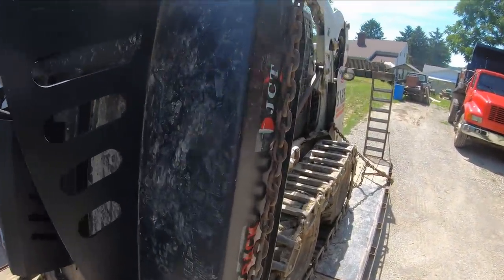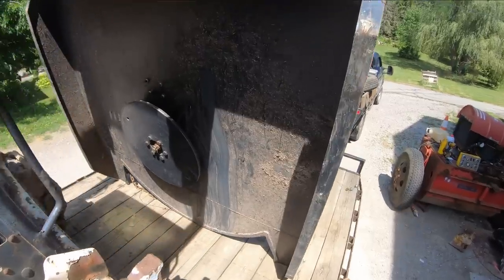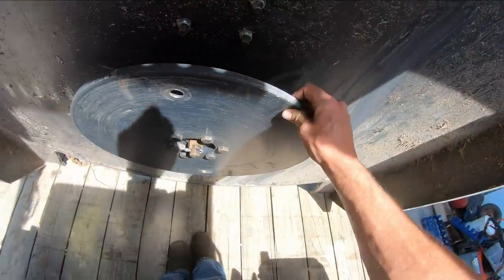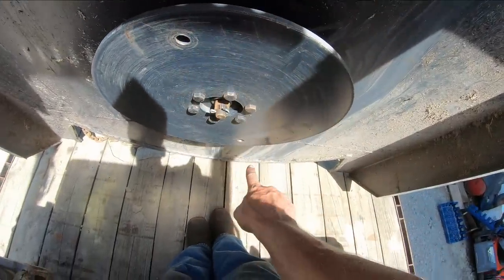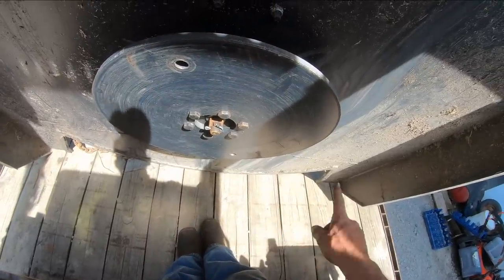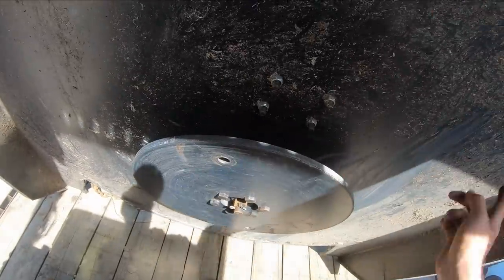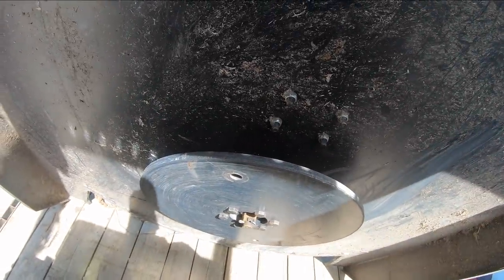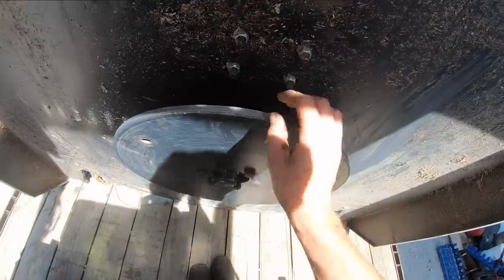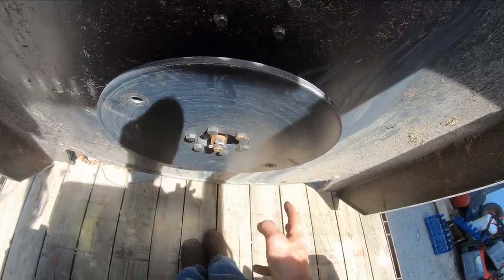Real quick — this is a JCT brand brush cutter. Here on the underside of the brush cutter, this is the plate that our blades bolt to. You can see there's a hole right here and one 180 degrees from it. A lot of the better brand brush cutters will have three holes, so you get more inertia, more blades cutting, more power. You could very easily take this disc off and drill it out for three blades.